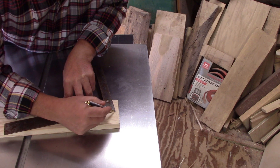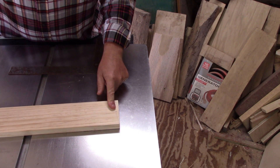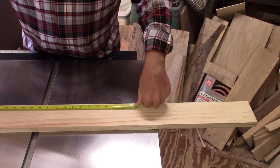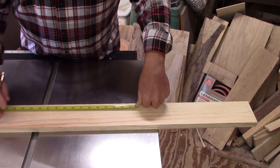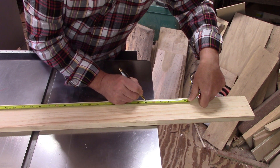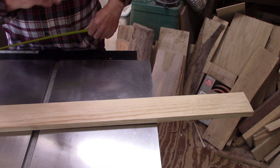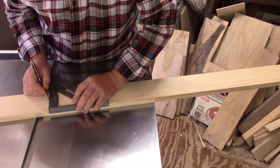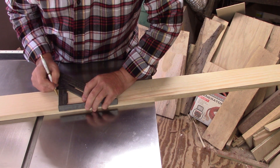You go to the back side and you draw a line 90 degrees to that, and that will stand perfectly up against your wall in relation to whatever angle you have on the top and the bottom. Now I'm getting ready to lay out my rungs. I decided to put my rungs 14 inches apart, and that gives me five rungs. I'm just marking them on the side, and I will come back and mark them with my speed square — just marking the centers where the rungs are.